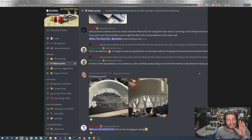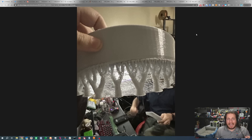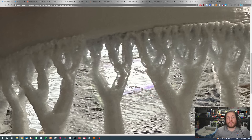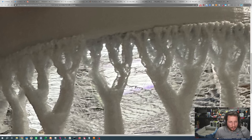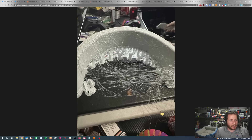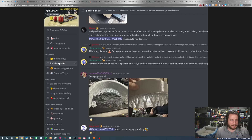If for some reason this isn't a wet filament issue — I think it is, but if not — this would lead me to look at retraction. We do have some issues here with bad extrusion. If you're not retracting enough, or retracting too fast and creating back pressure in the hot end, you could see this. This was submitted by Chris Catlett, a fan and patron of the channel. Looking at what I've got, I'm pushing toward wet filament, but I would also check those retraction settings to make sure everything is copacetic.